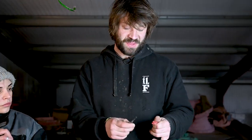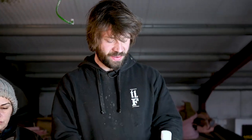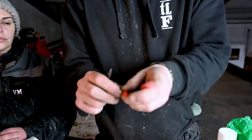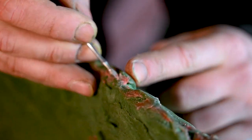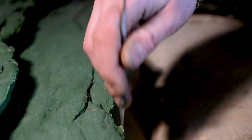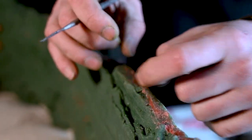So then you're left with the original cast. Vera's using a blow torch, a sculpting tool, and a bit of white spirit to blend in all the wax and give it that softness which some of the sculpture requires. The wax we're using is this red patching wax — it's really soft in your hand. You get a little bit on the end of your tool and patch in any holes that were missed when casting the wax, blending it in and staying within that seam line, because when you bolt and slush cast the mould it leaves a little bit of flashing. So we take away that flashing. You can see it's very thin — I can just knock it back, then get a little bit of white spirit on the tool and blend it in, staying within the seam line.